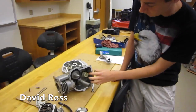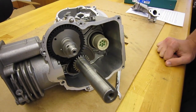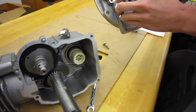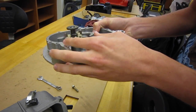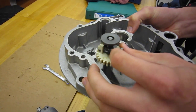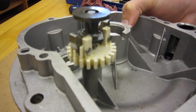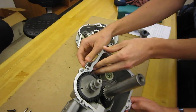Another part on the inside of our engine is this diaphragm here. This is a device that allows exiting but not entrance, and there's an oil filter on the inside. So when excess pressure is built up, it will force oil through the filter. On the inside of our housing, we have another gear which, as it spins, opens up these arms on the outside. When these arms are fully extended, it's going to prevent further rotation. So this is an RPM limiter, which keeps the engine from spinning faster than it's designed to. It comes in contact with this rod on the inside, which is connected to our fuel intake.